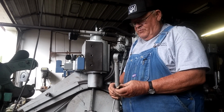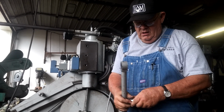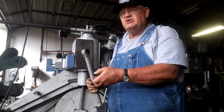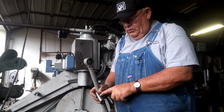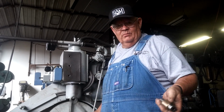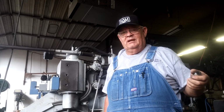So they went to this bronze bushing setup, and this is the piston pin that goes in here. It's hollow here, and it has a hole here, and it comes out on the side of the piston, and that oil tends to scrape into here better and transfers through the hollow pin, through this hole, into the bushing. And it seems to be a better setup. They are constantly working to improve these hammers. I've been associated with them since 2000, and there are many changes, and I think they've all been beneficial.